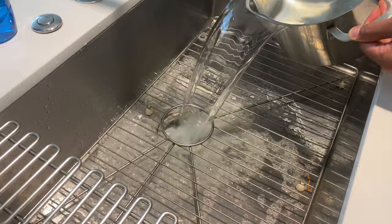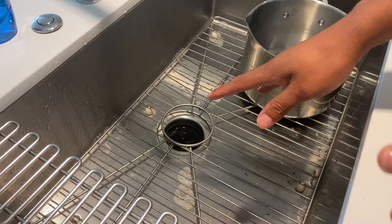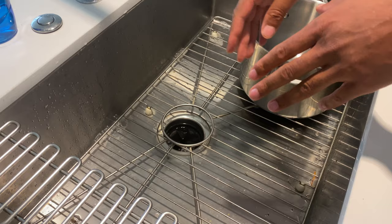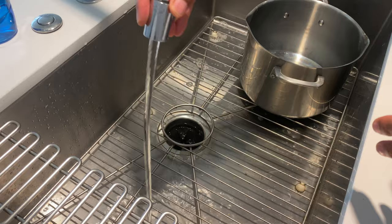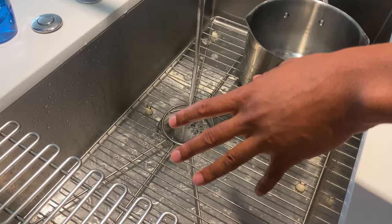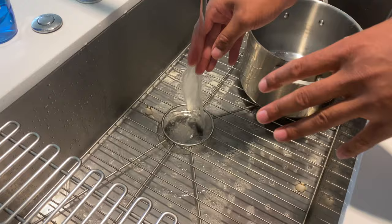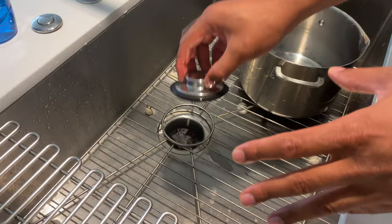The boiling water is dissolving any oil deposits in there, and because I added so much water, any food caught up in the drain has probably been released. Now rinse out your sink a little bit. If you still feel unsure, fill up the sink completely with warm water, then turn on the disposal and drain it with a full sink — that should remove any gunk remaining in the drain.